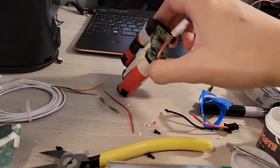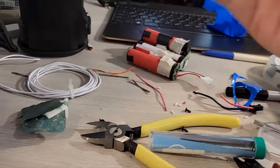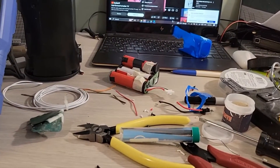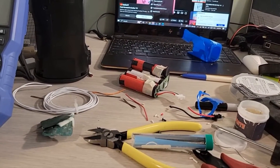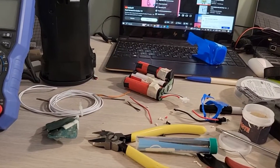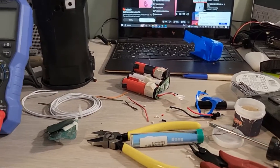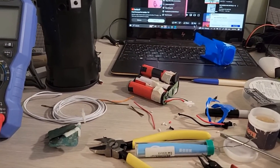This is the old battery pack and it's using one of these BQ battery management chips by Texas Instruments. They have software in there, so once you replace the cells you have to restart the whole data logging system — restart the clock and everything — so it clears the old data, because the chip thinks the cell is dead and it's not going to try and charge it.